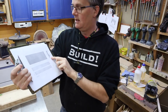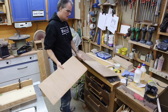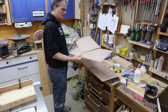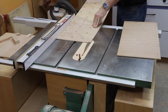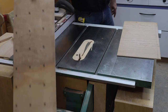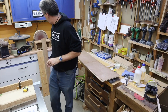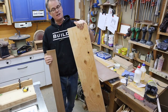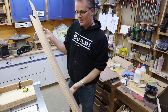For the back I need a piece that's eleven and three-quarter inches wide, and I've got three pieces of plywood for that — one will go the full length and these two pieces will give me something roughly a half inch wide. For the back it's not that critical because it's going to be against the wall. For the shelf with all the notches I need something three and a half inches wide. I have a piece of construction plywood that's almost five-eighths, so I'm going to put a piece of eighth-inch cherry on top of that and glue them together.